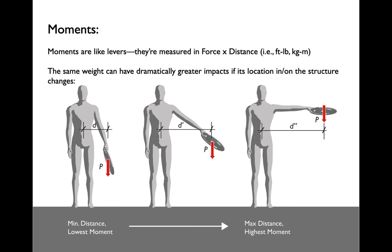or closer in. So this is that same principle, right, that a very, very tall structure is subject to overturning moments because of wind. Here, the longer your arm, the further out you hold that weight, even though the weight is the same, the larger the span, the greater the bending moment around your shoulder. So this gets to be really crucial, right?